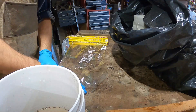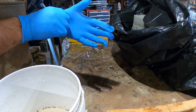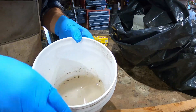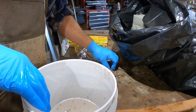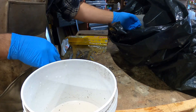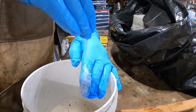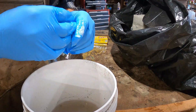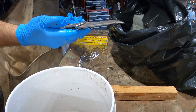I don't preach a lot of safety, but I'll point out a few things — this is acid. I've got some baking soda mixed in water to neutralize it. I'm wearing gloves because my hands will take it, but I don't want to get it all over everything. If I put a little bit of this on the baking soda solution — you can see it bubbling and diffusing the acid. When I get it on my forearms it'll start burning. I want to be able to wash my tools — I've got a knife I'm going to use to pull some of this apart and I want to rinse it off when I'm done.